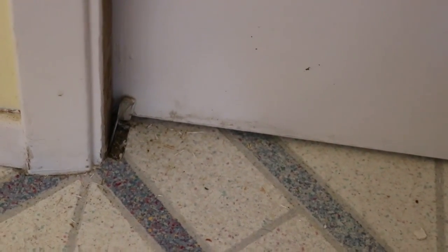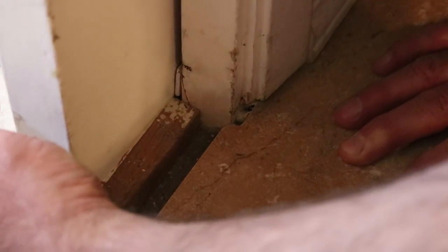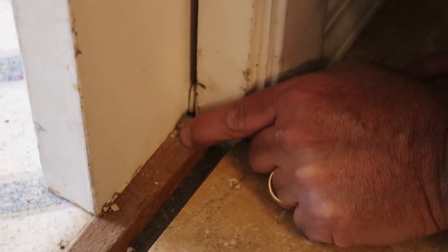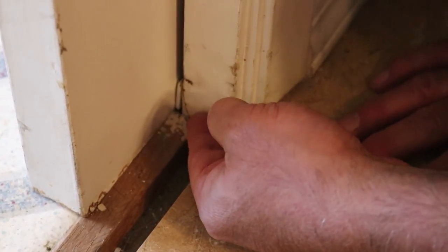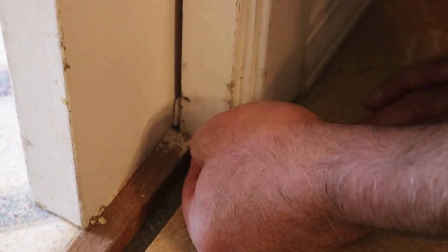On the back side of the door there's also one of these little guides. The guide we were looking at on the other side wraps under the door frame and is secured behind this piece of molding. This molding goes pretty deep into the floor and has another piece of wood backing against it. I'm going to take this piece of molding out, but rather than struggling to remove it I'm going to take a back saw and just flush-cut it — we can fill that in with caulking later.